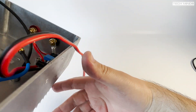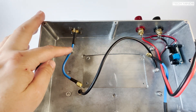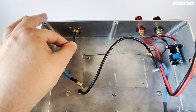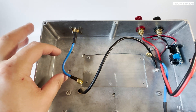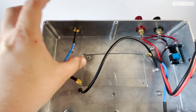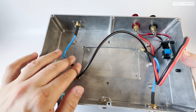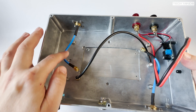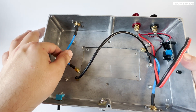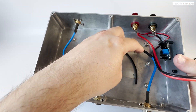Let's take a look inside. The input and output RF connectors have been terminated with short runs of SM14150R rigid cable — extremely high temperature and low loss, which is exactly what we need when dealing with the kind of power this amplifier can handle. That's for both the input and output. This cable is actually quite nice to work with and very easy — the input comes in on this side.